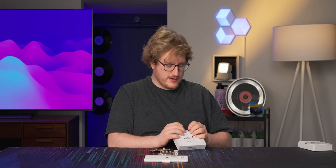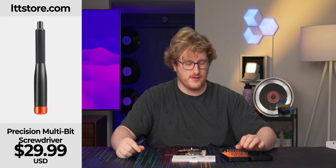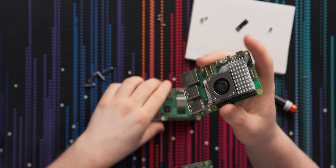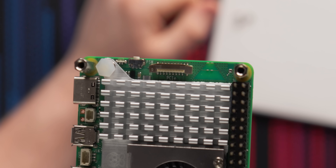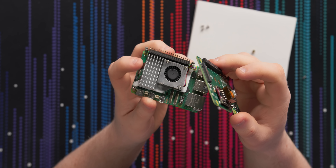Products like this that are meant for nerdy nerds sometimes just don't even come with instructions — you just gotta figure it out. Like with our LTT Precision Screwdriver set right here. Very orange, very precise, very LTT store. I think I'm gonna use a different Raspberry Pi — I wanna use one that has the official Raspberry Pi cooler on it, just so it runs a little bit cooler, and because I wanna know if it all still fits. Got our standoffs on there. See that there, it says PCIE, that's where we wanna go. And the metal parts of the ribbon should face inward. Now for the fun part, trying to stick this on while also inserting the connector here. Not always the easiest thing to do.